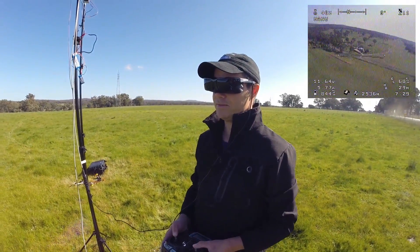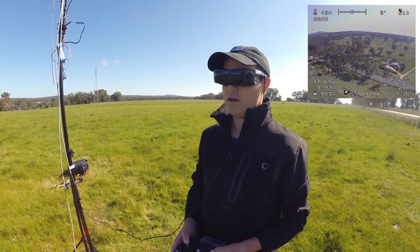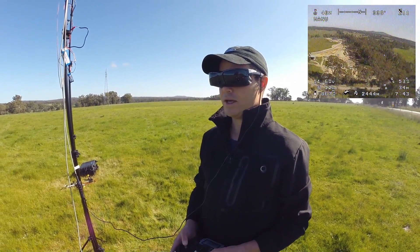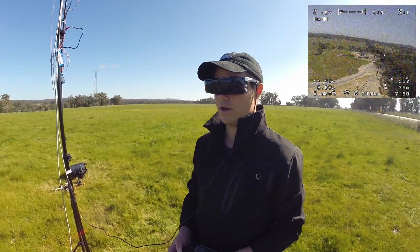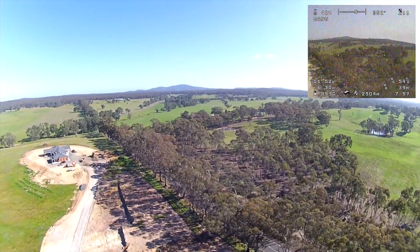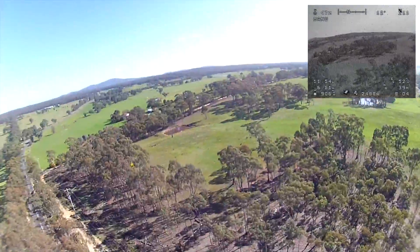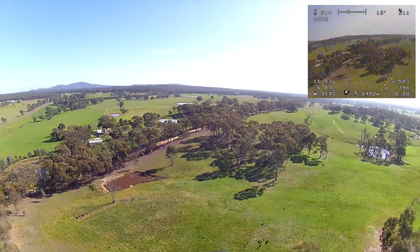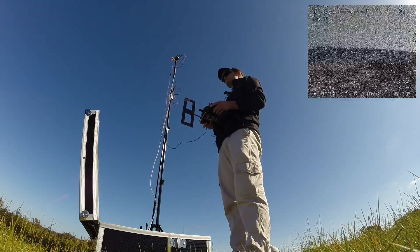This system is not like conventional GPS-based trackers. It's an RSSI-based tracker — a stepping stone in development. It took a few months to perfect and a lot of hours, but it works quite effectively. It's simple and uses items people likely already have in their FPV box, like the RC305 receivers, which are good receivers — it gives you a chance to repurpose them.